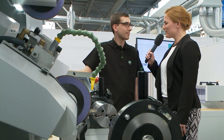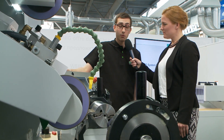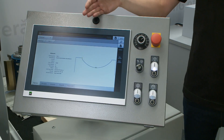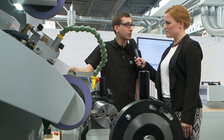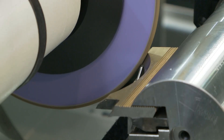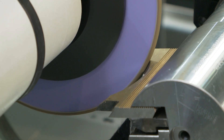It is just a matter of a few steps to tell the machine what it has to do. The Molder Master data arrives here at the machine control panel, meaning the CAD drawings are translated into a CNC program for grinding. The user then just has to select a tool, define the operating parameters, and place the tool on the blank in the machine. The machine then operates the tool automatically.